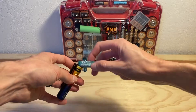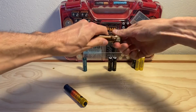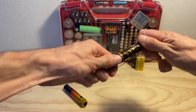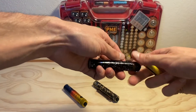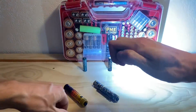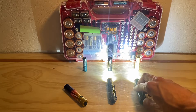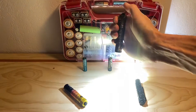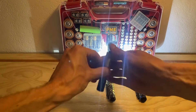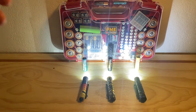I'm going to pop the batteries in so I can just talk while they're heating up and you can see what happens in real time. The sunset i5T or autism awareness version has the Olight i5R 2.4 volt battery. The brown desert one has the 3.2 volt lithium iron phosphate. And the black one has the 3.7 volt lithium ion cell. With the lithium iron phosphate and the lithium ion battery, you lose the low mode — they just become single-mode operation lights. With the i5R battery, you retain two-mode operation: low as well as high.